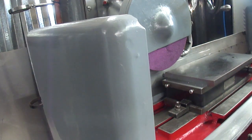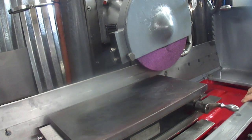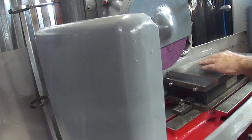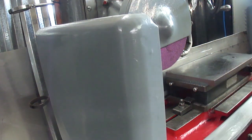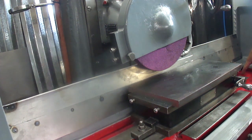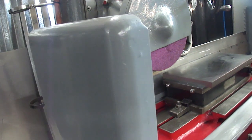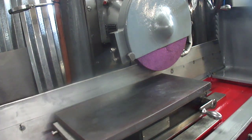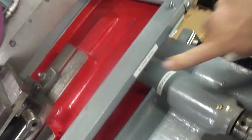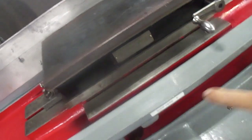Just make sure my travel is okay. How far can I go? I'm going to go back just a little bit more on this, because about the only thing wrong with this grinder is down here on the geared track — two, maybe three of the gears are broken off. So I'm limited. I'm about an inch and a half shorter on my travel on this side than what I really need to be. And if you go all the way to the end, I've got plenty of room to stop here. I've got it marked on this side just for my reference — I've got an X for stop here, stop here on the safe zone. I've got about another inch and a half of travel, and then I have it on the other side so I don't bang anything.